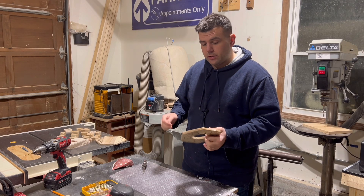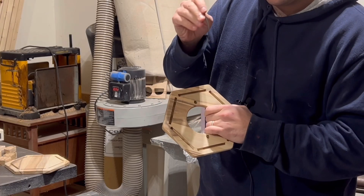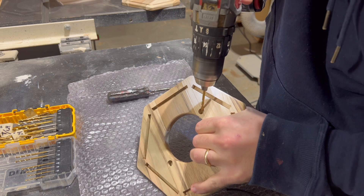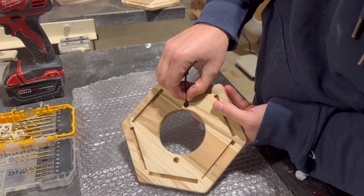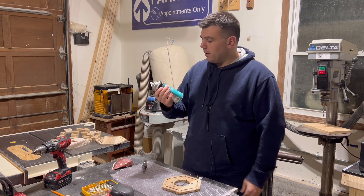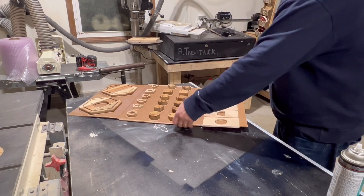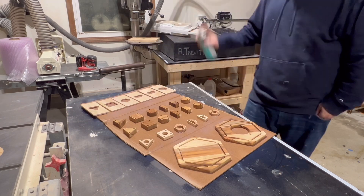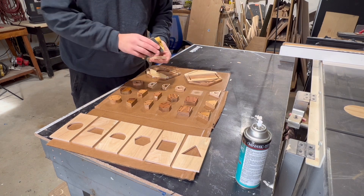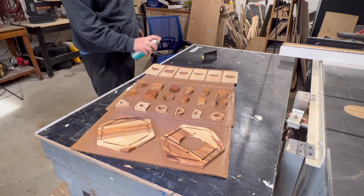Before finishing, I need to drill holes through the top cover so the elastic band can be secured. I used a 1/16-inch drill bit to make a starter hole on each side, then finished with a 9/64-inch drill bit, which is big enough to fit the elastic band. For the finish, I'm using polyacrylic — normally I'd use spray lacquer, but since this is for my daughter I chose a water-based varnish for safety. I applied two coats on each side, using 800-grit sandpaper between coats and wiping with a tack cloth.